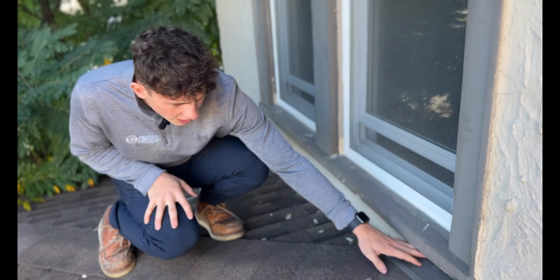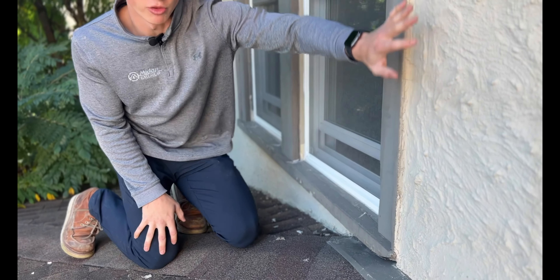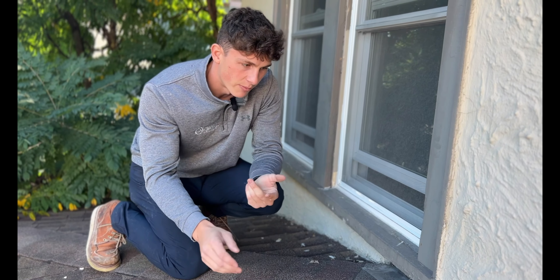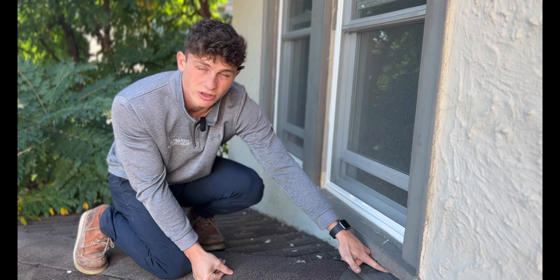So now that I'm up on the roof, I'm going to conduct a 15-point inspection. I'm going to take a look at flashings, gutters, window trim, and other things. We noticed right away here on Dana's roof that this pan flashing — where the window trim meets the pan flashing — the stucco is actually deteriorated away. It's supposed to look like this where the water that runs down the wall will go over the pan flashing and then onto our shingles and away. Unfortunately, the siding's deteriorated because it's a tight spot — probably no lattice or chicken wire in there to hold that stucco. So what we need to do is reflash this spot here, and then if they want to, they could put stucco here again, but we can flash it and take care of the problem ourselves.